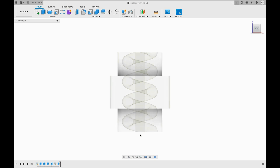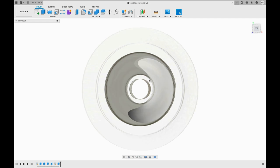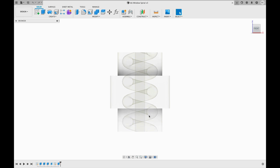When you fill the pen, the ink is going to travel through the breather tube up the center of this, and then cascade down through the spirals. It does a little of both — cascading down and also filling from the bottom. The central tube goes all the way through, and the spirals are completely independent of that tube, separated from each other. The ink will come up the central tube and then find its way down into the spirals.